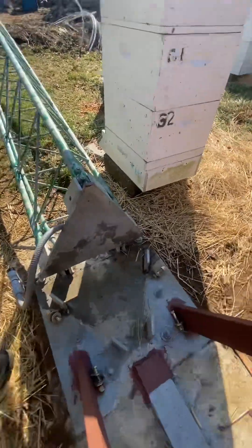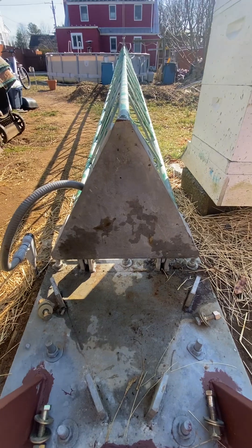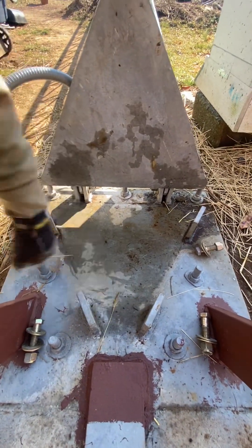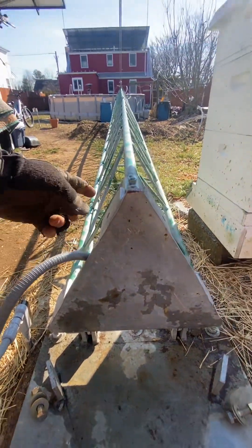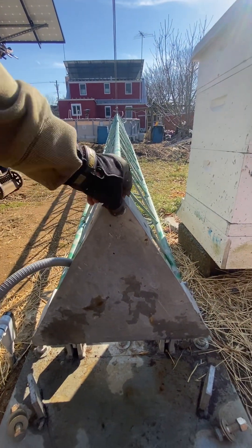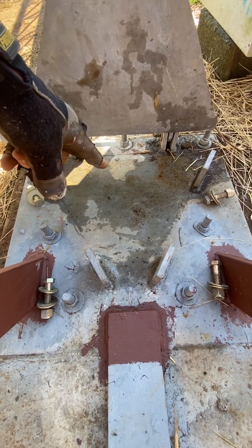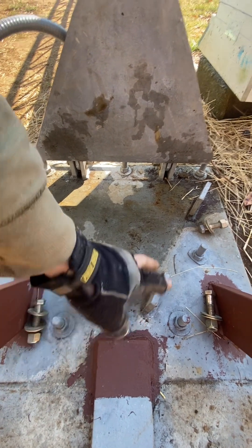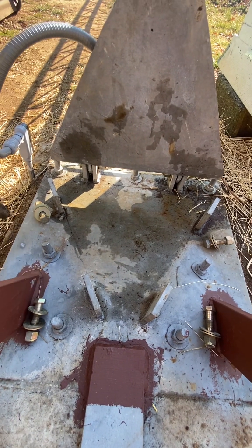Back to the tower build — make sure you don't have anything underneath the plate because whatever's underneath is going to get crushed, like these weeds. That's it for the half-inch plate. Hot dip galvanized, 25 by 25, hot dip galvanized. I did all the welding prior, so all the welds are cleaned and then galvanized. These were all placed when I poured the concrete.